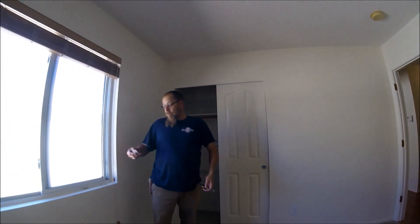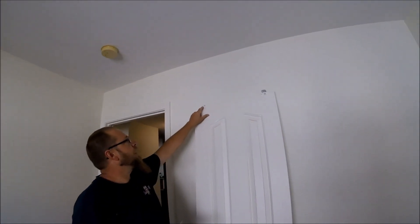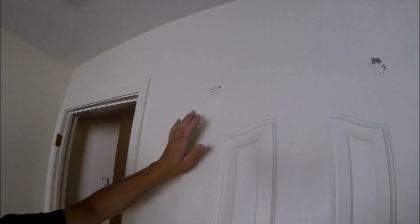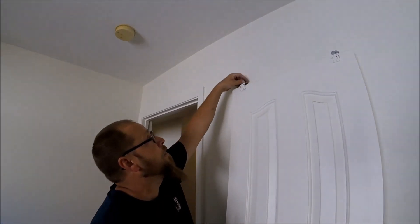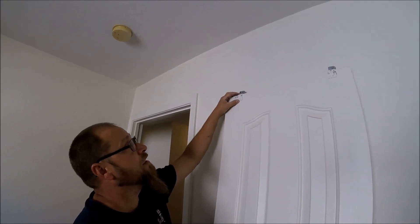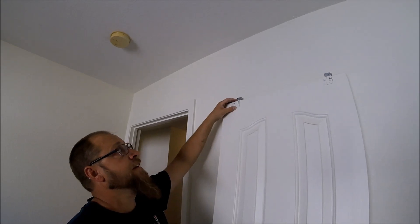As far as taking the doors off and putting them back on — a lot of times if these doors are handled too rough, these holes are not going to be real strong because it's a hollow door. If the doors get manhandled the wrong way, or kids bump into them, these holes are going to get wallered out. That's not a problem at all to fix. You can simply scoot over just a little bit, put some new holes in there, and then you've got a new solid surface for your screws to grab.